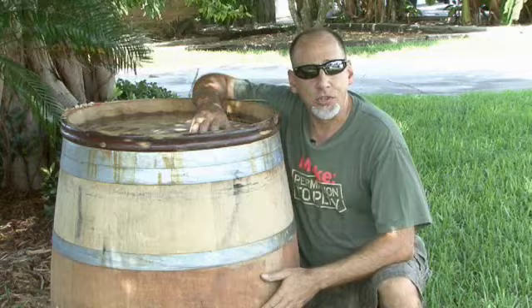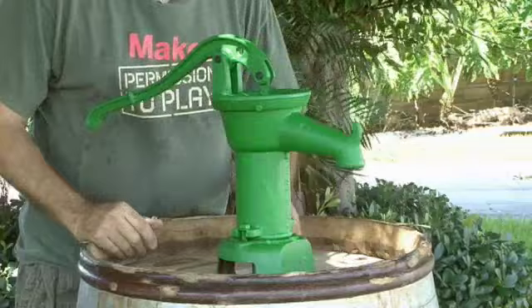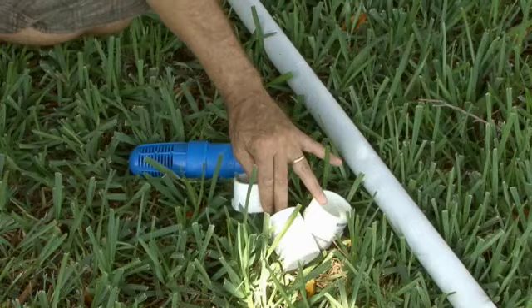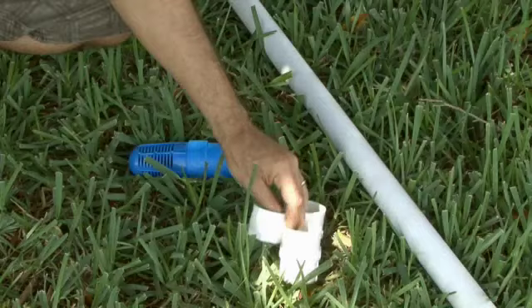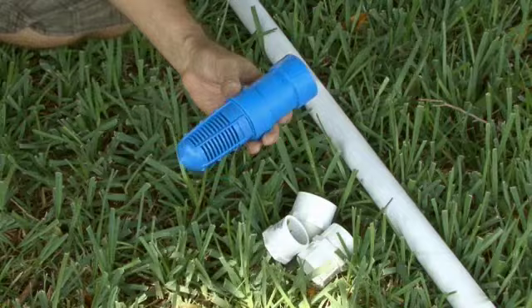There are quite a few different ways that you could get water out of this barrel, but this project calls for an old-fashioned hand pump. I got this one at Northern Tool and Equipment. To get the water out of the bottom of the barrel, we're going to need a length of PVC pipe — this is a one and a quarter inch diameter by about three foot length — and some threaded adapters that go to our hand pump and our foot valve. A foot valve prevents backflow and loss of prime, and it allows for an efficient flow of water, which will prevent us from having to pump a lot to get the water from the bottom of the barrel.